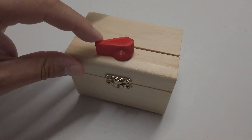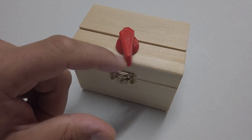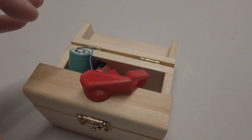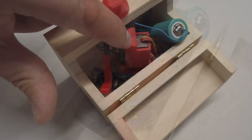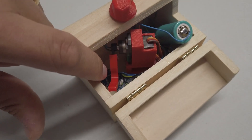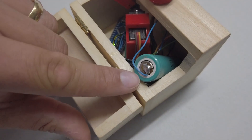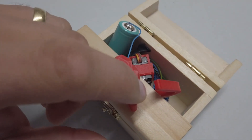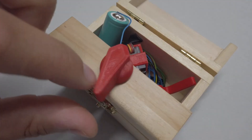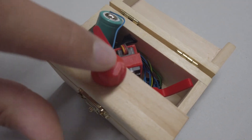So what's in the box then? Well, in the box we have a 3D printed plastic knobby that I've designed and made for a digital quadrature encoder. And when we rotate that around — it scares the crap out of me when it does that — but ultimately we have a little micro servo in here in a 3D printed plastic case. I've also 3D printed a little armature for it. Underneath that micro servo you can see a little Arduino Nano. On this side of the box we have an 18650, which is a little four volt lithium cell. You can calibrate the position of when the arm activates by pressing the knobby on top of the encoder.